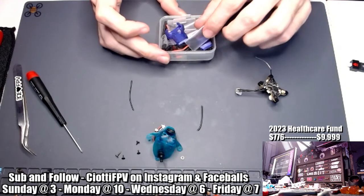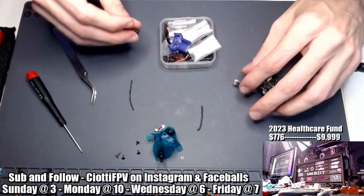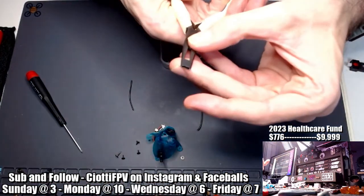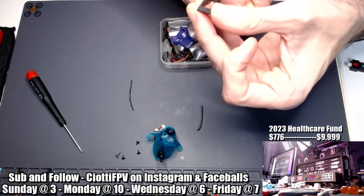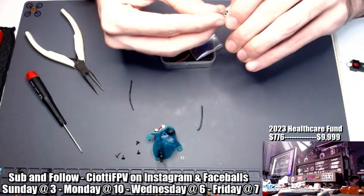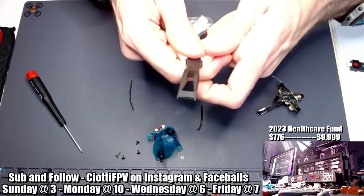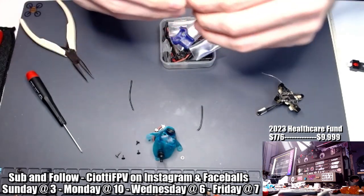So, all right, let's get a little piece of shrink wrap here. I'm just going to use this little piece of black because it's just about long enough. No, it's not. I need a little bit longer. Okay, that should work. I use shrink wrap that's a little bit too small, and then I just stretch it out. And that way it's going to shrink up even smaller. That's a little trick. You can't stretch it much. You got to be really gentle when you're stretching it, but you can stretch it out a little bit. And now it should, in theory, fit over here. I might actually need to go up a size. This might be a little too small. Let's try to give it another little stretch, though. There we go. You can kind of just feel it, like when you really start to pull on it.